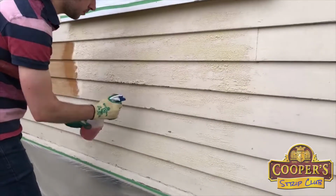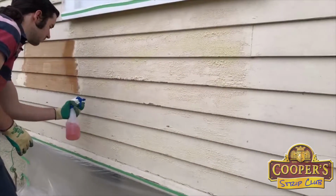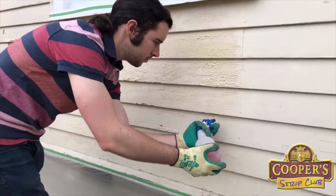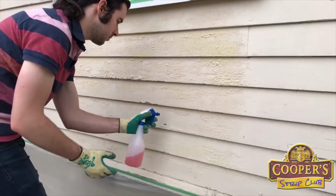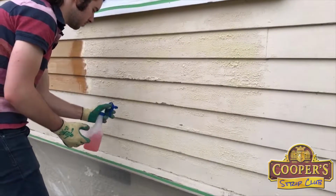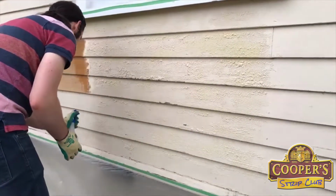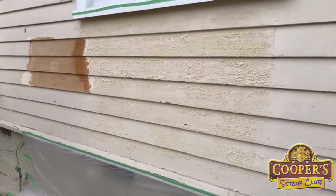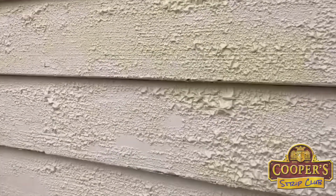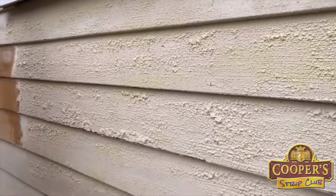Now often when we come and look at projects, we find that there's all sorts of different paints on. There's never just one type of paint. Mostly what we find is lead at the bottom, coated by enamel, coated by acrylic on top. And they're all fighting against each other, and there's often different levels of repairs and part strips from the past, and you find all sorts of things. And we'll deal with all those. It's a little bit like musical chairs where someone along the way gets the job to take off all the paints.